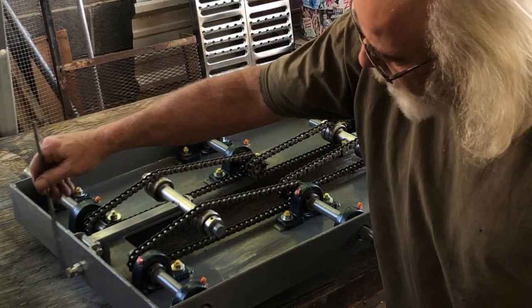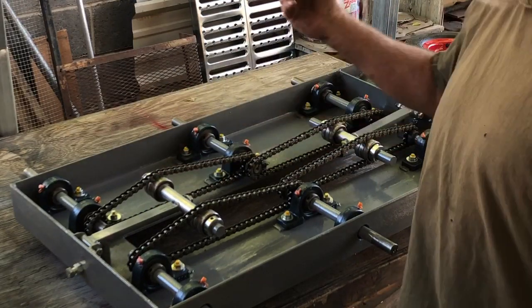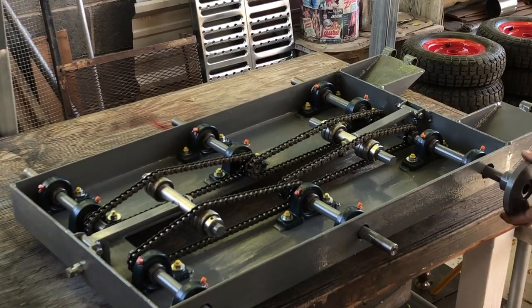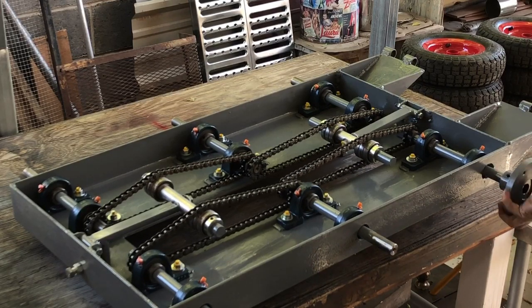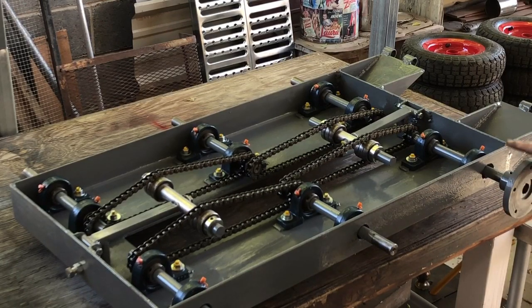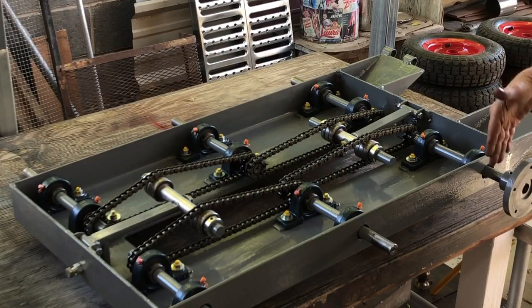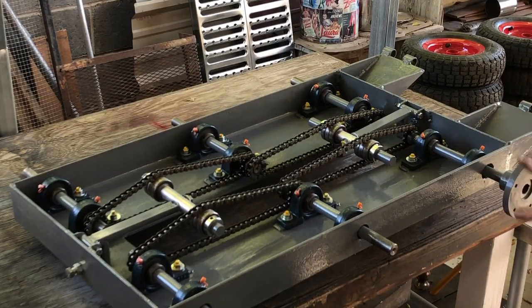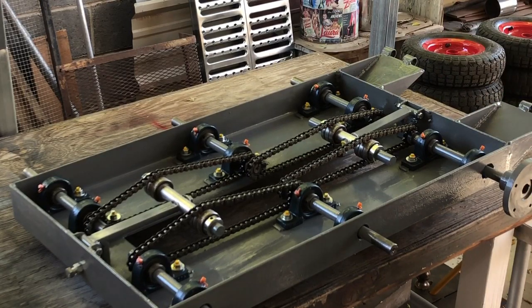And the same here. So I got a little jack screw. I can screw that bolt in and it hits the inside and it brings this up. Pretty simple. But as you can see, it turns all the shafts on that side based on the 9th and 10th sprocket, the big ones on the outside that the actual motors turn. Move this guy up. So when this paint's all dry, I'm going to flip it over and put it back on stands and I'm going to reassemble it.